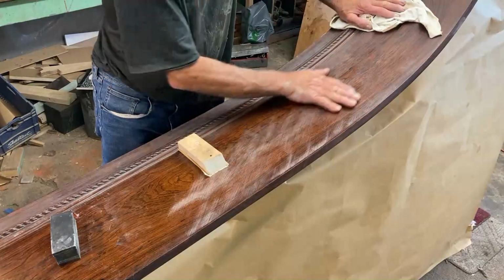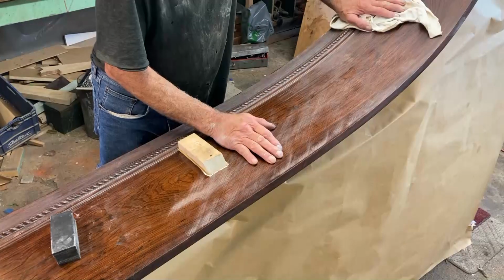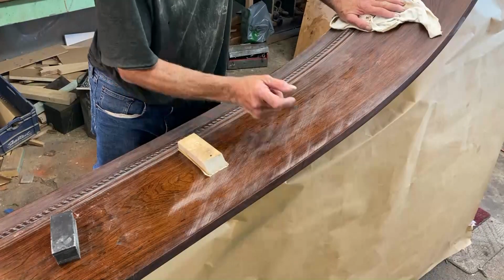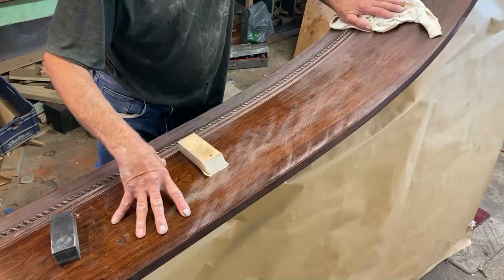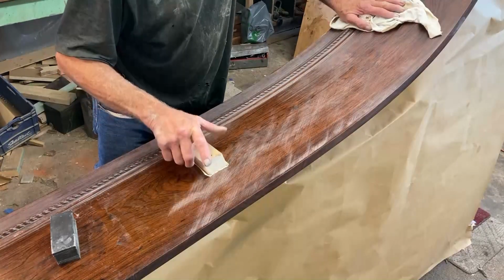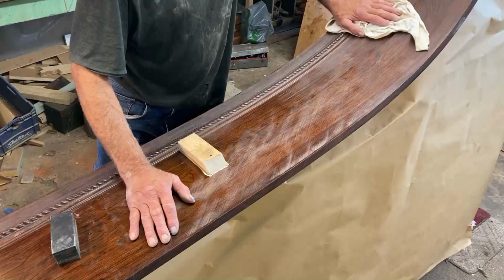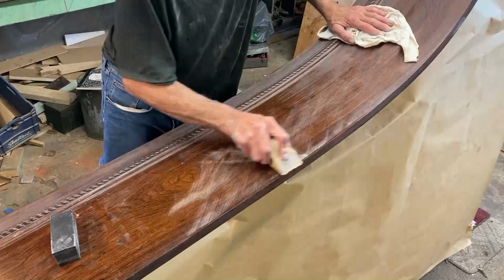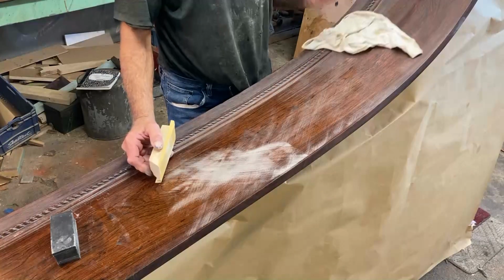it was swabbed with alcohol. Then I actually took lacquer thinner and a paintbrush. I didn't show that part, I don't think. Anyways, put lacquer thinner on here with a paintbrush and it melted the finish in. Then it was French polish with silica. One polishing. Then it was sanded down. Gave it another polishing with silica. Sanded down like this. Gave it another one with no silica. You don't need silica anymore.